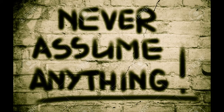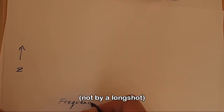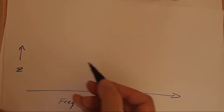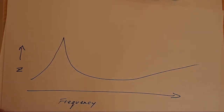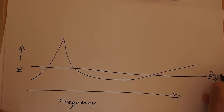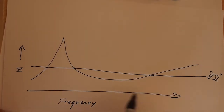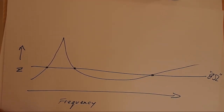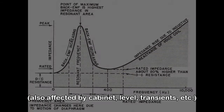This assumes the speakers are presenting a constant load to the output tubes via the transformer — but that isn't what happens, because an 8-ohm speaker is not a pure 8-ohm load. This is a graph of speaker impedance versus frequency. You have a big peak at the speaker resonant frequency, then the impedance goes out something like this. A straight line would represent a pure 8-ohm resistance. As you can see, the speaker only has an impedance of 8 ohms at three places — every other frequency is operating at a different impedance, and that changed impedance is reflected back to the output tubes.